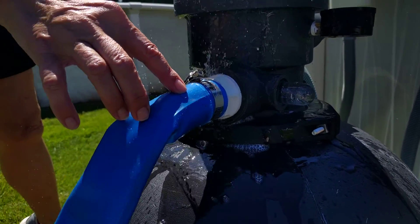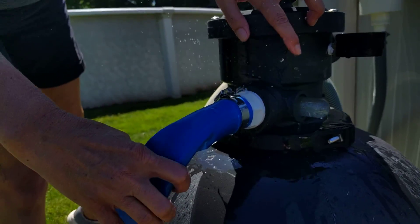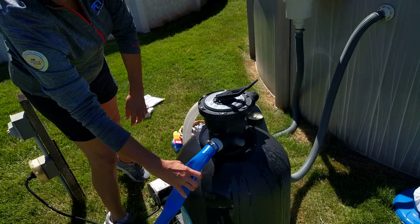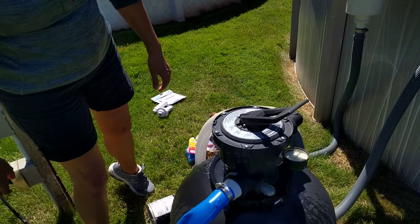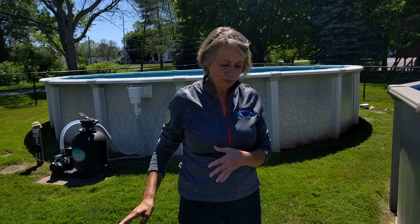Sometimes you get little pinholes in there. You'll see as this turns around, there are little bugs and little particulates in there. When that starts to clear up, then you know you're done backwashing. A good rule of thumb is no more than one to three minutes for a couple of reasons. One is that sand is coarse and sharp — just like the Grand Canyon, water erodes rock over time. That big churning of all that sand is going to wear down those nice sharp edges of the sand that catch organic material, making it less effective for filtration. The other thing is you're sandblasting the inside of your tank too. And also you're losing water out of the pool, so you don't want to do it for too long. So that's backwashing.